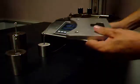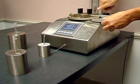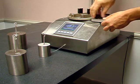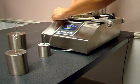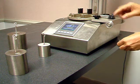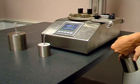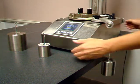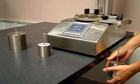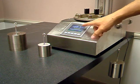There is also a frame that you have to attach, and use the knobs provided in the calibration kit to secure the frame. The next step is to make sure that the wire runs in the groove and stays secure in the small pulley, and hang the weight at the end. If you need clearance, move the machine to the side of the table to make sure the hanging weight is not interfering with anything else. Then press next.